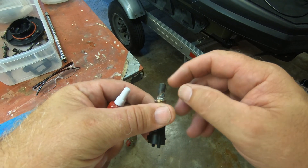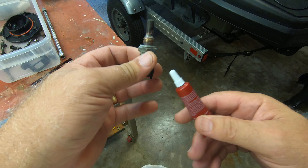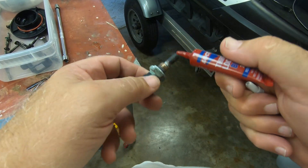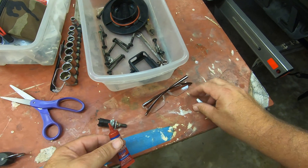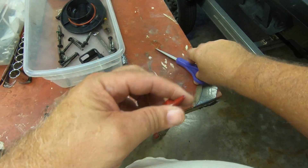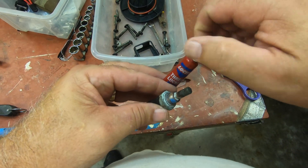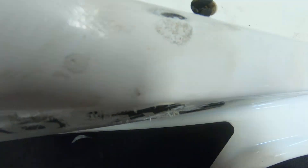I've taken a brush and cleaned off some of the calcium and hard deposits on the outside of the sensor. We'll go ahead and apply a little bit of blue Loctite on it. Be sure to keep this sealing washer, because it doesn't come with a new temperature sensor — don't lose it. We'll put a little blue Loctite on this and then fixture it back in the boat.